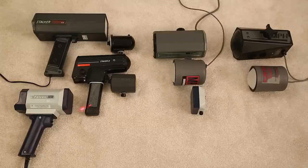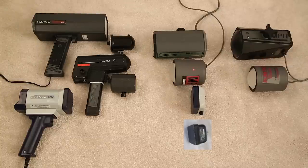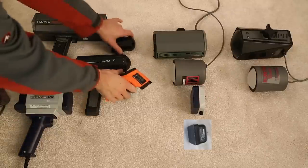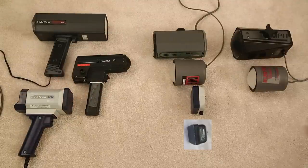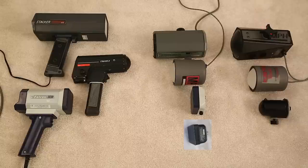There's a look at the different technologies used for police radar antennas: pyramid-shaped linearly polarized antennas, circularly polarized conical antennas, and linearly polarized patch antennas. And then various ways of shortening antennas — a full-length K-band antenna, a shortened K-band antenna with a lens, and patch antennas on K-band as the most compact option. This is also available in KA-band — the Decatur Genesis 2 is available in K-band or KA-band versions. KA-band will be even more compact. X, K, KA — older to newer, larger to smaller.